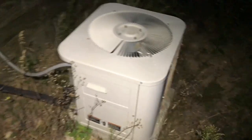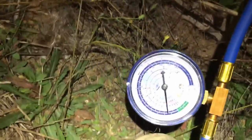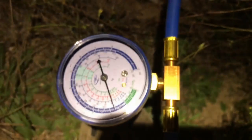Okay, so here's the beast. I believe by looking at this model number it was made in 1990. So that's my pressure — she's virtually empty. Let me pull off the service cap and hook up my gauge. This thing says 210 PSI on the low side and 450 on the high side. I'm only doing the low side, but I'm only going to bring it up to about 80 because that number just seems a little bit overkill to me.